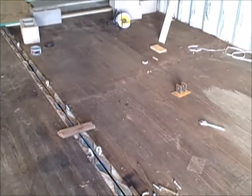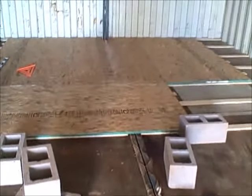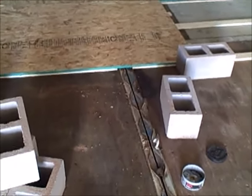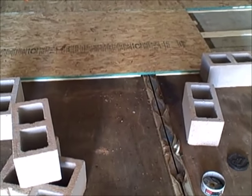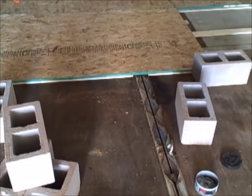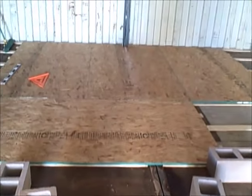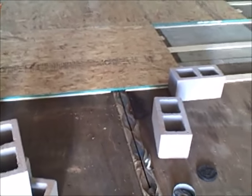This spot here where the two containers are joined together — well, they're not really joined together, he didn't weld it. He got bored and just decided to start putting flooring down. What I would do is get some big plastic tarps or eight mil plastic sheathing and put that down as a vapor barrier before putting the sub-flooring on. Without any of that, you're going to always have moisture up underneath the subfloor.